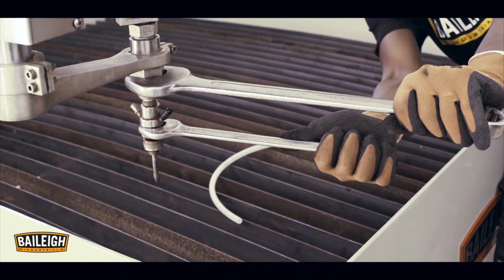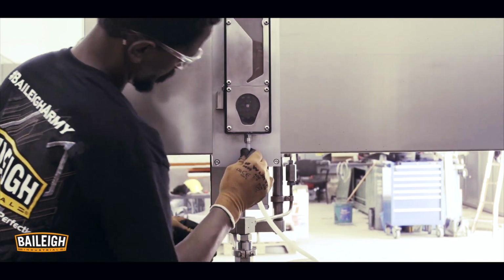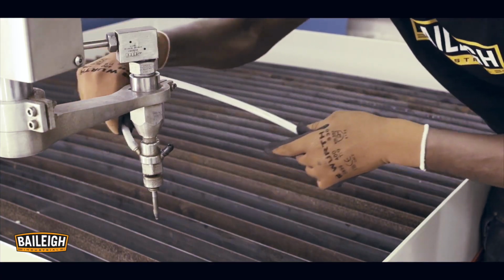Assemble the orifice and nozzle to the mixing chamber and this to the high pressure circuit. Connect the garnet delivery pipe from the mini hopper to the mixing head.